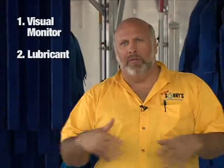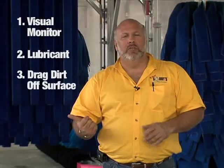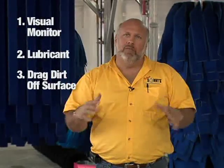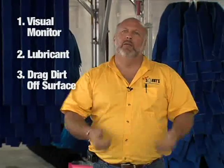In a hybrid car wash system, there are three reasons to use foam. Number one: we want to ensure complete coverage of the vehicle surface with the detergent we want to clean the car. Foam allows us to do that — if we don't see foam touching every area of the car, we know we didn't get it on there and the car may not get clean. Number two: we use it to lubricate. When using wraparound brushes and mitters for a safe, gentle wash process, you need to lubricate that cloth material to make it go around the car and be active on the vehicle surface. Number three: it helps drag the dirt off the car. The weight of the foam, as it runs down the side of the car wet and runny, actually pulls dirt down off the painted surface, which enhances the cleaning process.